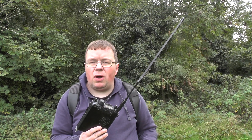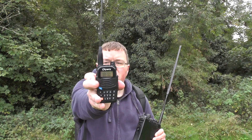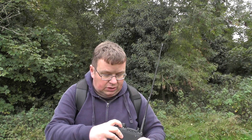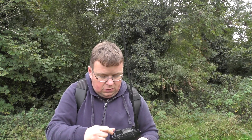I'm getting whistling sounds or high-pitched noises over the airways when I'm receiving audio. I'll show you what I mean. If I go on to GB3VH and key up with this OliWiz, you'll hear the audio come back - we got into the repeater, but on the FT817 you'll hear a load of static noise and whistling noises coming back.